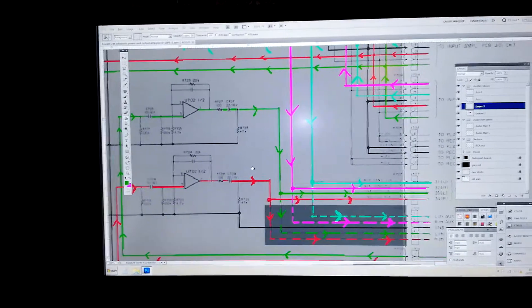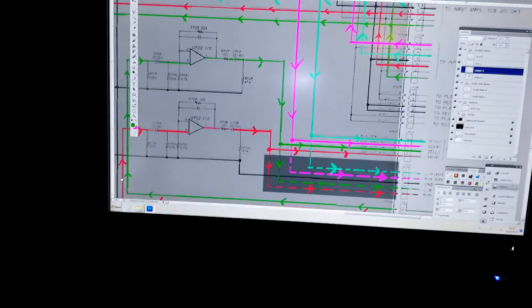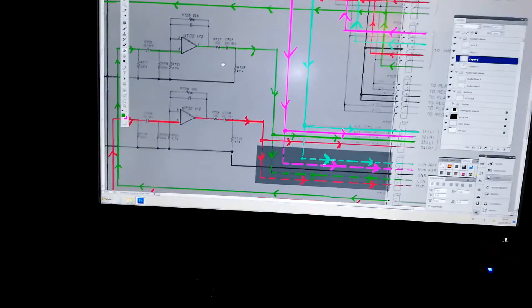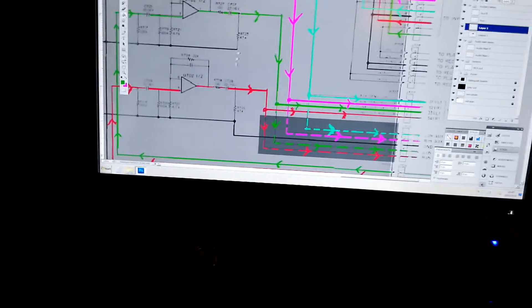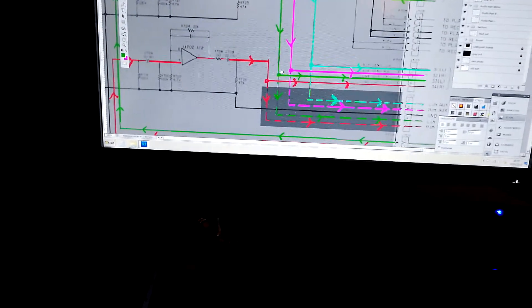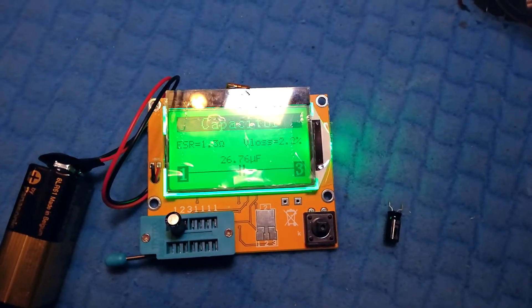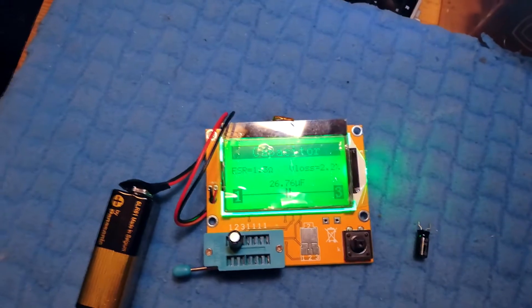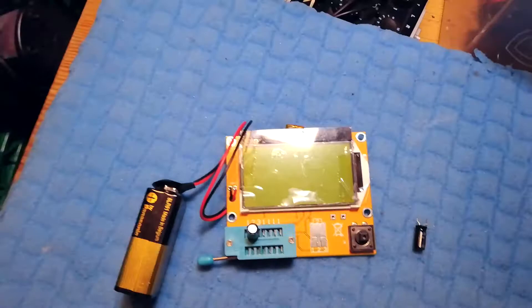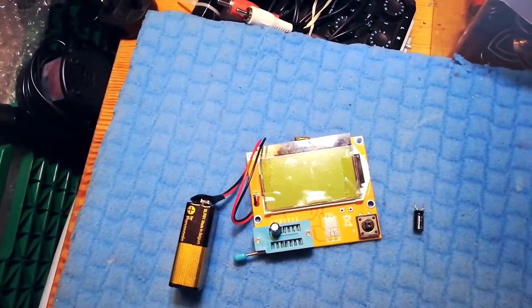Here's the schematic for the 244 output amplifier — this is how I tend to work; I annotate them and draw over them in Photoshop so I can better understand what's happening. Down there is the fader coming into this pair of operational amplifiers. They seem to be working, but you can see both of these pass through a capacitor — C707 and C708. These joints are where the signal splits up between going to the output jacks and to the headphone amplifier. I'll remove those two capacitors and test them. I've tested both and I'm getting pretty similar readings — they're rated at 22 microfarads and they're in the 26 microfarad range — I'm not seeing an enormous equivalent series resistance or anything making me think either of them are faulty.